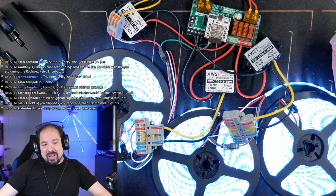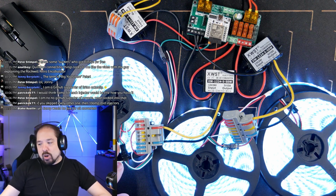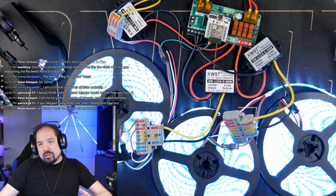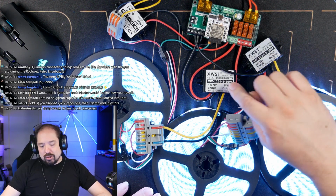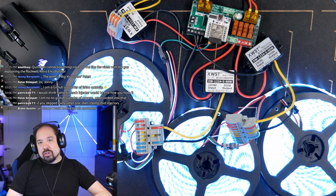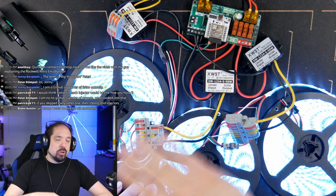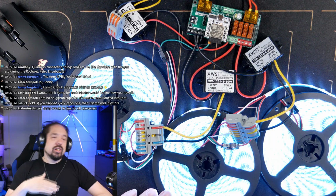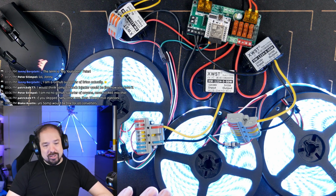No, so I don't agree, Blake and Patrick, that 5 amp would be fine because, well, 133 watts incoming, sure, there's some conversion loss somewhere, but that's 26 amps at 5 volt. So if these would have been 5 amp converters, that wouldn't have worked, or they would have been heavily overdrawn. And especially if one would fail, the other one would be even more overdrawn. So I'd always caution on the high side, getting 1 or 2 models above what you think you'll need, versus what you think you could get away with.